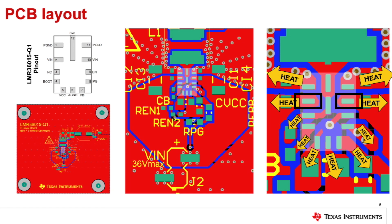The second most heat comes out of the VIN pins in this design. The layout has a large hexagonal polygon for VIN which allows this heat to spread and dissipate. We also see polygons on the other pins — AGND has a moderately sized polygon so some heat will flow from there. The other pins can be better utilized if better thermal performance is required.